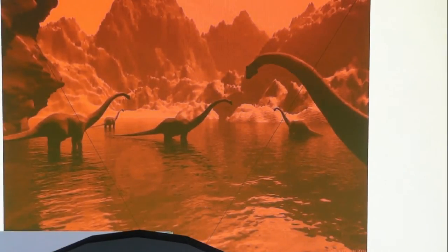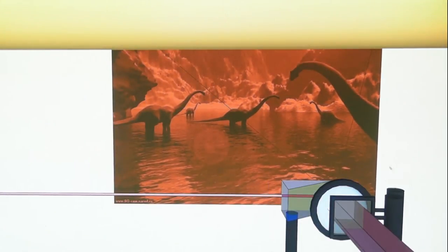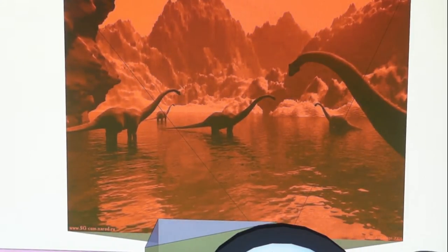The hologram is printed with all the viewing angles, so we can see the left and the right face of the scene, but also above and below. The appearance of one holopixel looks like a two-dimensional picture of the hologram. But if it is printed with only the left to right information, as in most cases, one holopixel has the appearance of a series of vertical lines.